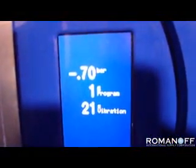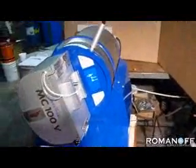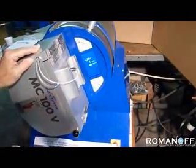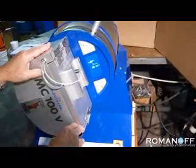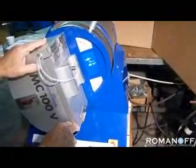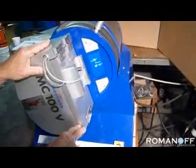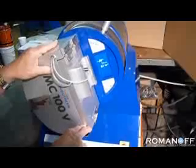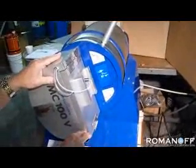It's indicating the amount of vibration time remaining, going down to zero. The power is off and the metal is cooling and solidifying while the vibration is on and also under pressure, so you should end up with a very dense casting. The vibration is finished. We now have it in the cooling cycle, whereby the metal is cooling, changing from a glowing red to a dark area. We generally want it to go to a complete cooling cycle so that before you open the chamber, the graphite crucible is black and not red. This increases the life of the crucible.